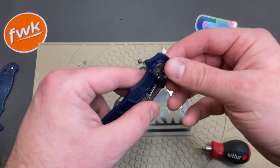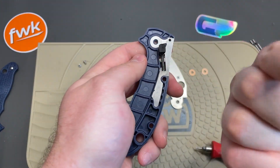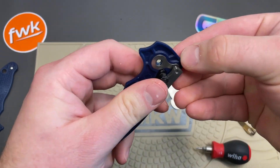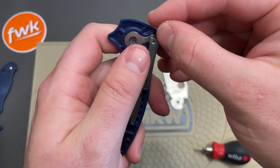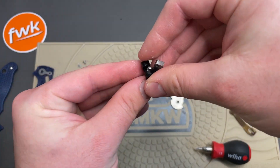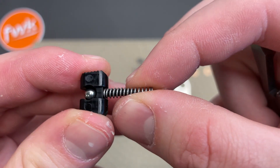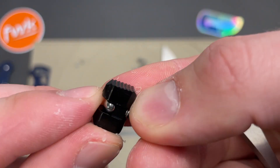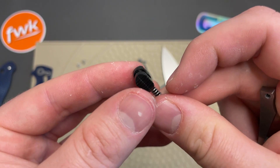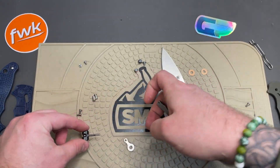So this is the tricky part — not too terrible, but the lock bar needs to come out and the cage needs to come with it, and the ball bearing will be floating with it at that point. Just remove that a little bit and the lock bar should come free. Here is your ball cage, the steel ball bearing, and the spring. Note that one side is captive so the ball can't come out, but it can come out the other side. This side points up within the knife towards the spine.